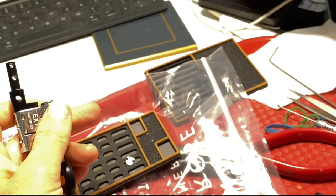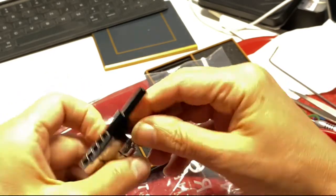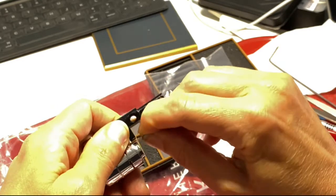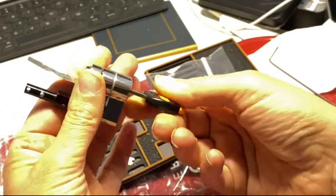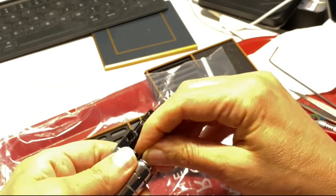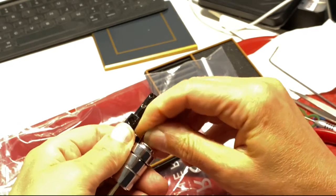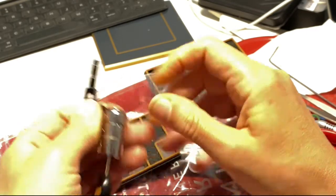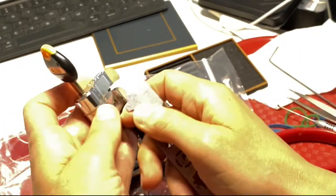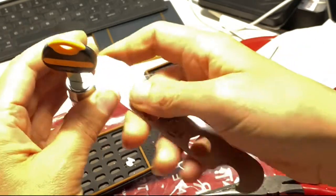Actually, I'm going to start to feed in, for luck, turn the key a little bit, which lets you feed in the shim, which you'll notice, the core is not moving out. Why the heck is that? Well, it's this circlip, and I also have pliers around here to help pull that out.